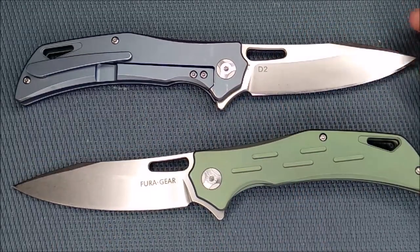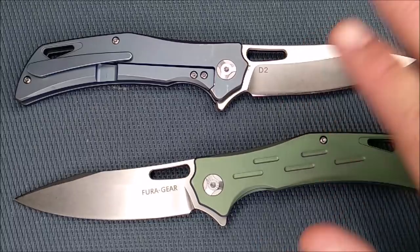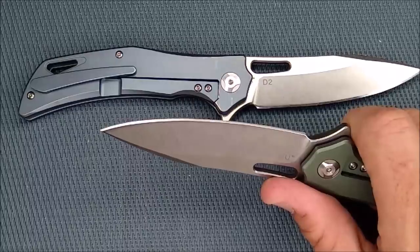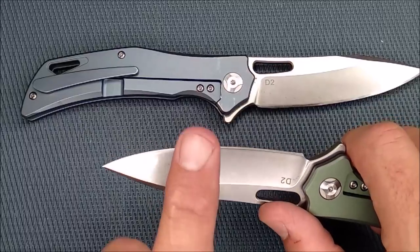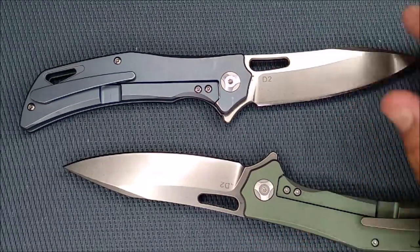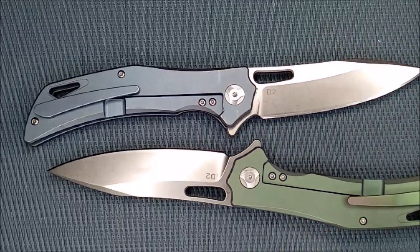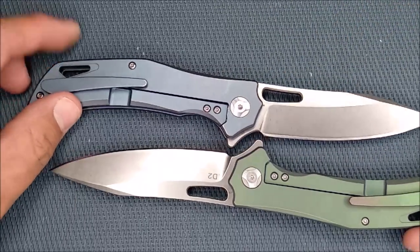In my experience with sharpening I can tell how hard a steel is, and it is fairly hard — between 59 and 60 on the Rockwell C scale. I think it's a good steel. Was it durable during use? Yes, I cut a lot of stuff with this and the factory edge cut very well. This is still a factory edge — looks good, cuts well, just at a crazy angle. You can get it to 20 degrees per side without too much work. I wish they would have done better from the factory, but it's good quality steel for the price, even if it's not D2. Nice stone wash on there, nice chamfer on the cutout — really, really nice looking knife.